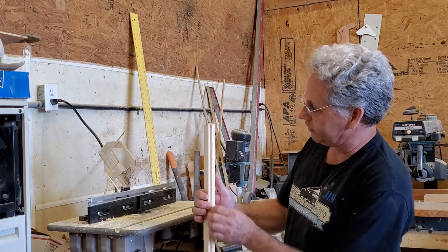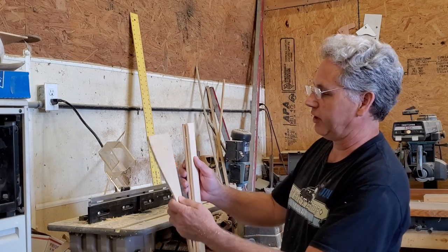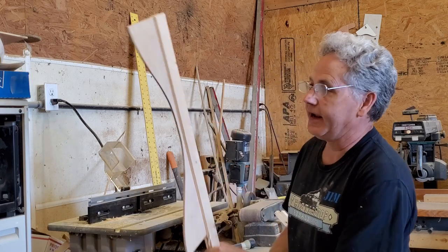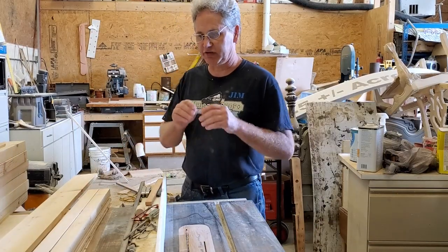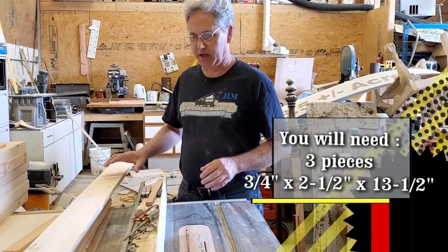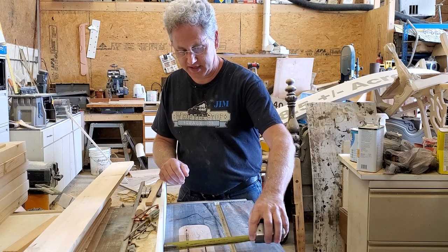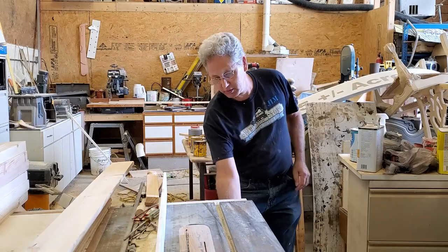There is your mortise cut in that piece. A piece of quarter-inch plywood will slide tightly and nicely right into that groove. The next thing we're going to do is cut a two-and-a-half-inch stile for the center of our panel. I'm going to take the remaining lumber from my one-by-six that was ten feet long, run it through the table saw with the fence set at two-and-a-half inches, push sticks close, and run that board through.